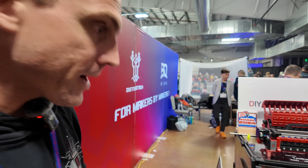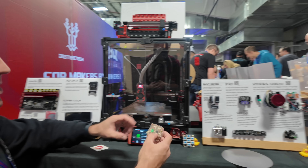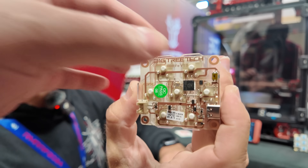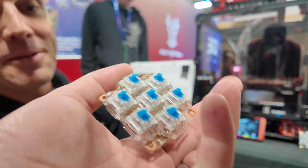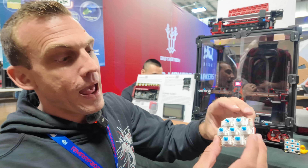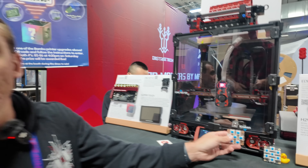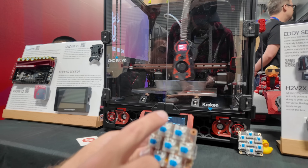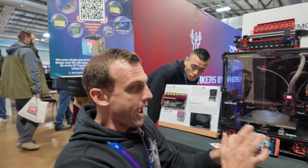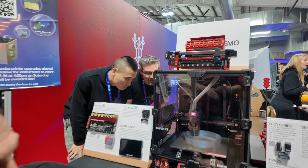We've got to show you these — that is a completely see-through PCB. It's just a really, really sexy little macro keyboard. It's running a little RP2040 — plug that thing in to your main board, and when you hit one of those keys it'll trigger whatever macro you want. We've got some special skirt designs that will fit into your Voron skirts and just screw in place. We've also got printable keycaps that you can put whatever graphics or icons you want on, corresponding to the macros you've assigned. It's a really cool little solution that gives you quick and convenient access to commonly used features — load, unload, preheat, that kind of thing.